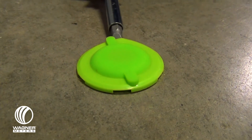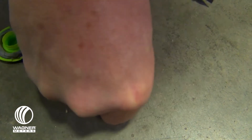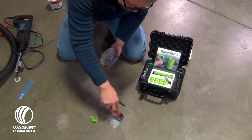When you look at the metal disc, it's really intended to be used like this: you go through, you install the sensor, you get your readings, you finally figure out which way you're going to go — it's dry enough to install, or you need a better adhesive or a moisture mitigation system. Now you're ready to do your final floor prep before you finally install the floor. You take this metal disc, put it inside the RapidRH sensor, and skim coat it into the floor.